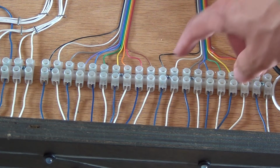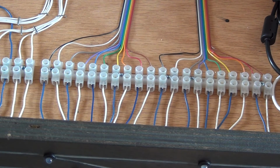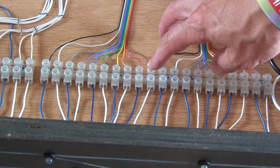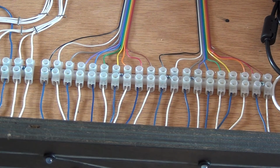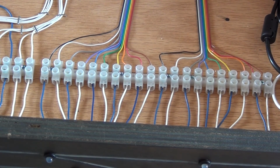If you remember, pin 1 is the brown, and that's actually the cathode. I'm sorry, the anode, which is pin 1. And I got all the wires hooked up. The white is the anode, the blue is the cathode. So you can see I got all those hooked up. 2 detection zones, detection zone 1 and 2, and let me show you how we got these wired up.